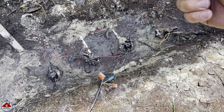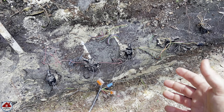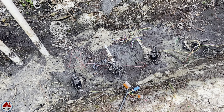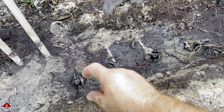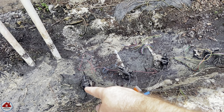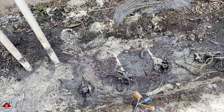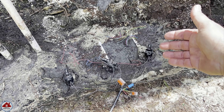This area I dug up got all flooded, but it hadn't rained. So I scooped the water out with a bucket to let the puddle dry out. After several sunny days the water hadn't come back, so I turned on the valves by manually turning the solenoids to let my lawn get watered, and I didn't see any water leaking from the valves. I thought I broke a solenoid gasket, or possibly cracked a pipe while digging. But the water hasn't come back even though I've been running the sprinklers — because that wire was sitting in the puddle, they stopped working, which is why I had to manually turn them on.